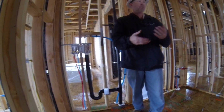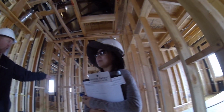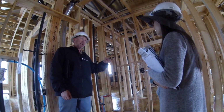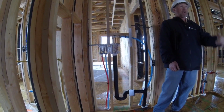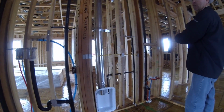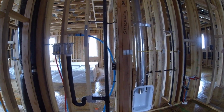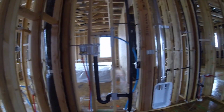It's got a charcoal filter and all that stuff that it does. It puts a mineral in there that's toxic to plants. So when Shane walks you through, he'll show you where your landscape shutoff is, because your landscape water is like the fire sprinkler. It bypasses your house water too, that feeds into the house. Pretty cool. And it all ties back in by the curb. But when I say your house water, I'm talking about your line at your garage. That's the separation point. As long as we bypass that, it's considered separated from the house, but not the property. All right?